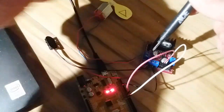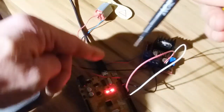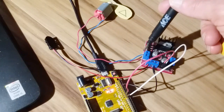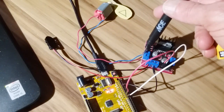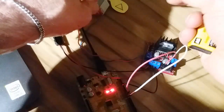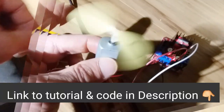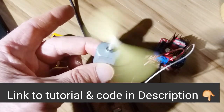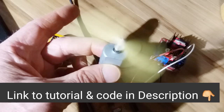I've actually detected about, even with the 9-volt battery as an input, a 1.5-volt drop to about 7.5 volts coming out of the output which connects to the DC motor. I think I've set this for 3 seconds — that's going clockwise right now.